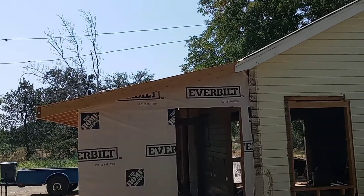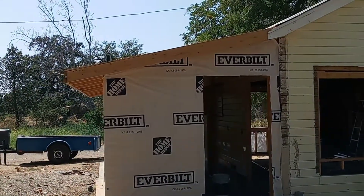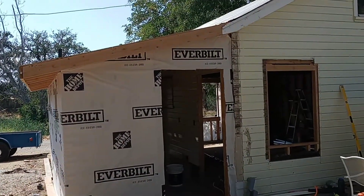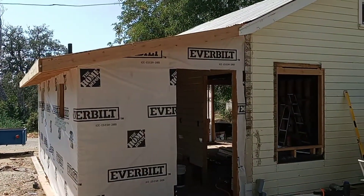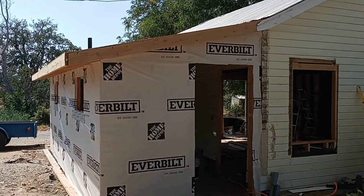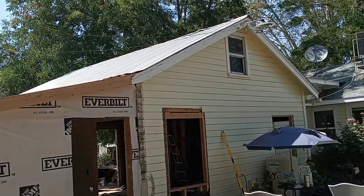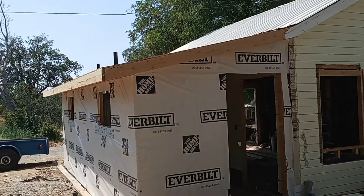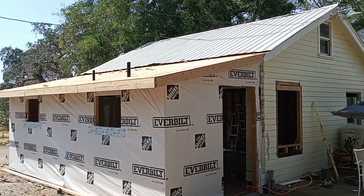This video is about framing an addition onto the long wall of the building as a substitute for a lean-to. If I had done a lean-to here I wouldn't have nearly enough headroom to come out eight feet and still preserve at 3 and 12. So that addition is at a 3 and 12 slope and we're in a situation where we're joining to a much steeper roof, and how we handled that in particular with the rafters and the way the rafters were tied in and framed.